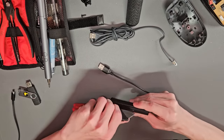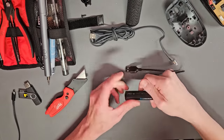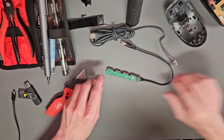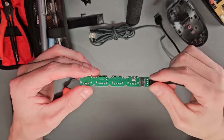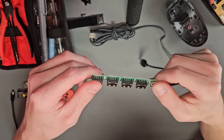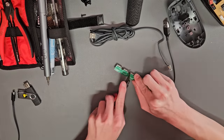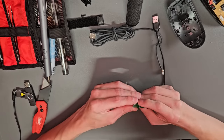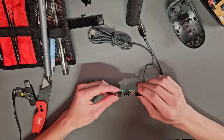Same thing with the USB hub we're using. It is a double-sided board, but that doesn't matter here — it's cheap and easy to hack. We don't even have to take out any screws; just use a sharp implement to pry the case open, being careful not to stab yourself. You can see the USB hub chip is at one end of the board, and that means everything else is dumb — transparent. The USB hub has no idea that I'm about to cut off two of its ports. Taking a sharp knife, we're going to cut through the traces and just snap off the end of the board.